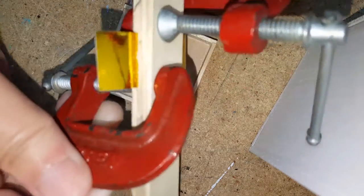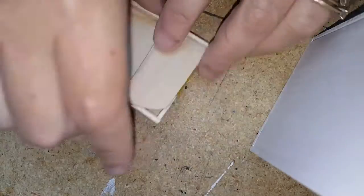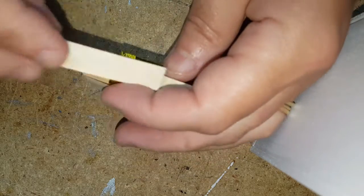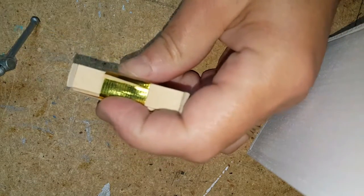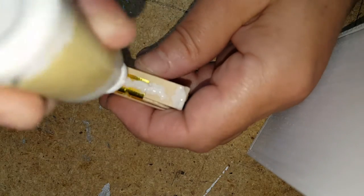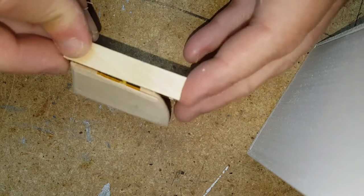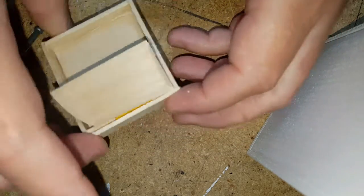Then clamp your doors if you're using the duct tape hinge so that the glue will dry securely in between. If you're doing the duct tape hinge, you put it between the wood so you don't see it, and then tape it on the outside. Take the additional pieces and glue them right here — cut right in the middle or close to the edge so the hinge isn't seen. Add some glue all along here, make sure it's secure, then take your additional piece and glue it right on top so you don't see that hinge.